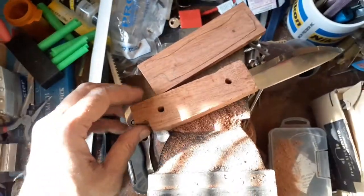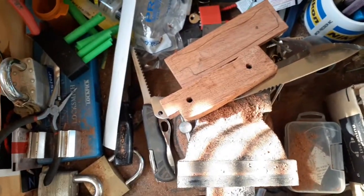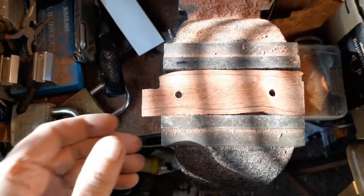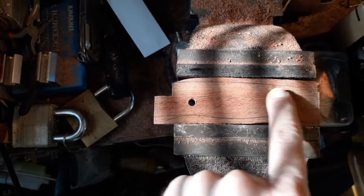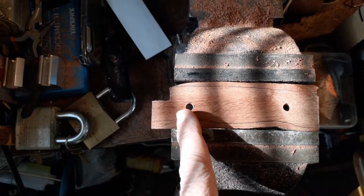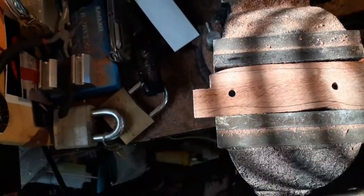And now I'm to the point where I'm gonna countersink the screws to match, so that it won't bite into the wood here, but it'll go down deep enough. So I'm gonna have to use a wider drill bit. Let me go find those screws too. This is where, if one side of the wood is better looking to you than the other, that's where you flip it over. This is kind of a little bit better looking side than the other one. They both look good. But now I've got to countersink this.